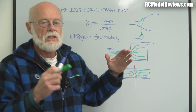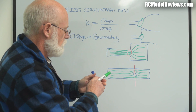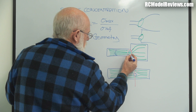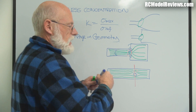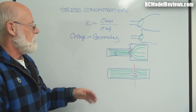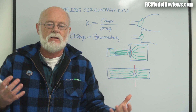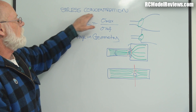With gentle corners the stress lines remain relatively smooth and won't get bunched up as much, whereas sharp small-radius bends cause the lines to overshoot and be actually closer together even at the same material width. So for maximum strength: smooth curves, not too many holes, and all changes in geometry should be gentle and subtle — not sudden, right-angled, or sharp. Another key factor is how much material remains after you've drilled your holes — how much actual material is left.